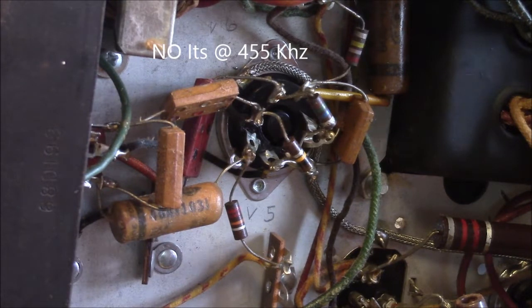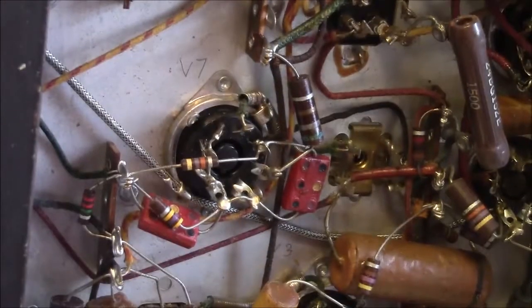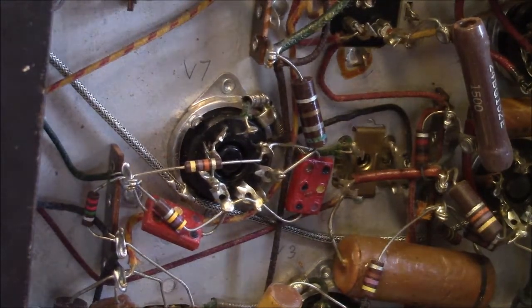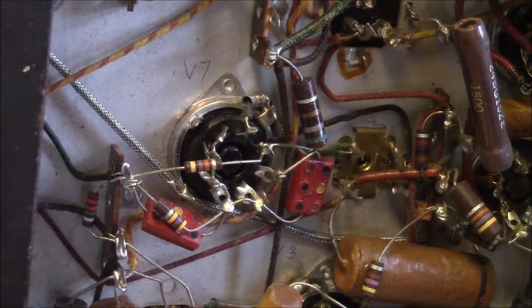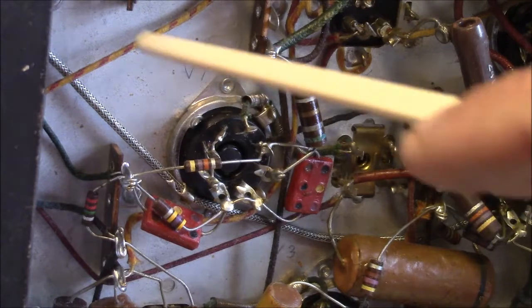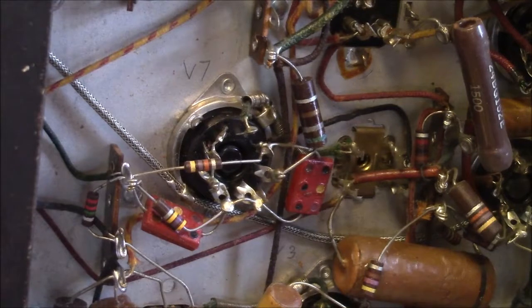So be a little careful poking around in there and thinking that you need to move something, or something's loose, or that's not connected. That is really true on the littler ones. They get these little baby Hallicrafters. I can't think of the part number right off the bat. They're little, all American 5 type radios. They're pretty cheaply built, and they're kind of deceptively dangerous. They've got some goofiness like this, and a lot of times you'll just see a wire kind of scurry through somewhere, and it looks pretty innocent. So be a little careful if you get to tinkering with one of those.